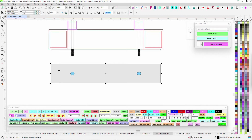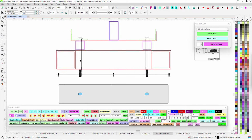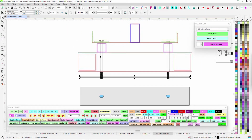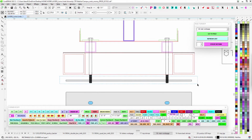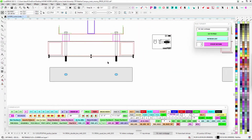So I got these spanner washers. Basically you're just going to take this washer and drill through, and if you miss this, fine. If you catch a crossbar, then perfect, because then you can just bolt it to that. Anytime the existing frame has a crossbar, great, but it's not imperative that you hit exactly. Our sign will sit on the crossbars, and then you'll use this as a big old washer, suck this up against there, and this will clamp the sign